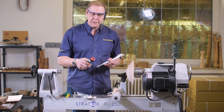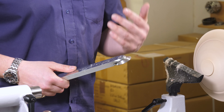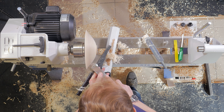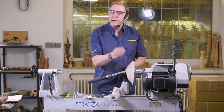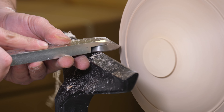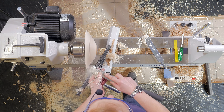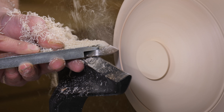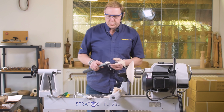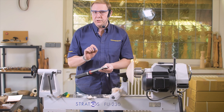The end is 16mm, so it just fits into my 16mm handle system. The round one is normally used on the inside of bowls, but just to demonstrate how it works, I'll use it on this area. You can see the bevel rubs on there — it's slightly bumpy — and that's why I would want to use this tool, just to smooth all of those out. You can use it in both directions, so it's not particularly a push or pull cut; it will work in both directions. With the round one you're only actually using a small amount, so you get to rotate it round, and it will last a long time once you've got that sharpened edge.